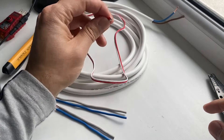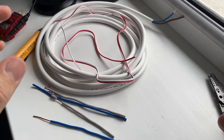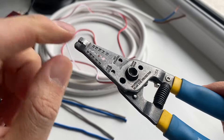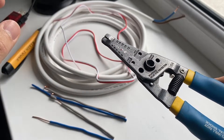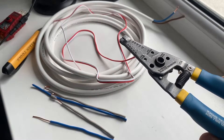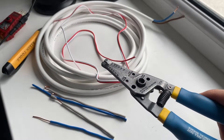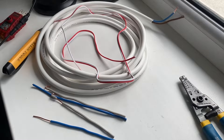Number two: when you are stripping wires, especially stranded ones, please make sure that you wear glasses. Even my stripper had a warning about it. When I was an apprentice I was not allowed to have my glasses off unless I was on lunch break. Please make sure anything you're going to touch doesn't have power, and also have your glasses on.